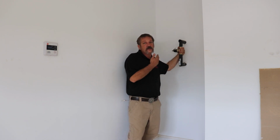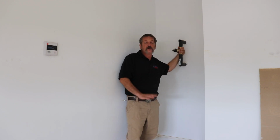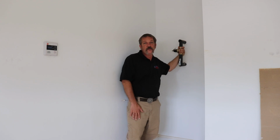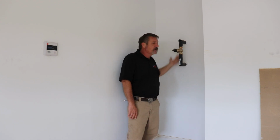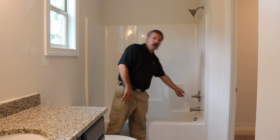But you're going to want to stand here, feel this, and make sure that water shuts off after a few seconds or so. If it's just still running and you're standing here for 3 minutes, you better go check because something could be spraying all over the place. But most of the time, somebody left a sink on. But that's where you're going to start. Well, start with your tub shower. Go ahead and turn that thing on.